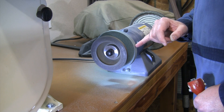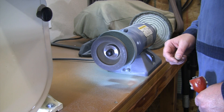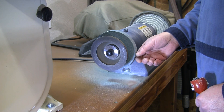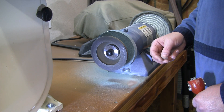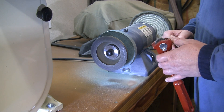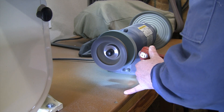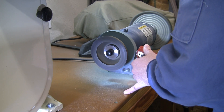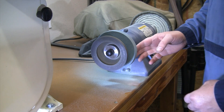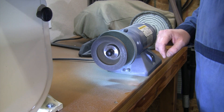You can see that in order to get that dent out of there we had to take a little bit off — got lots of dust down here on the bench from doing that. I tend to find that the diamond dresser just smooths it out a little bit too much; it doesn't cut as aggressively. So I'm just going to touch that now with this star dressing wheel to make sure I've opened that wheel up again — it'll tend to cut brazed carbide a little better.